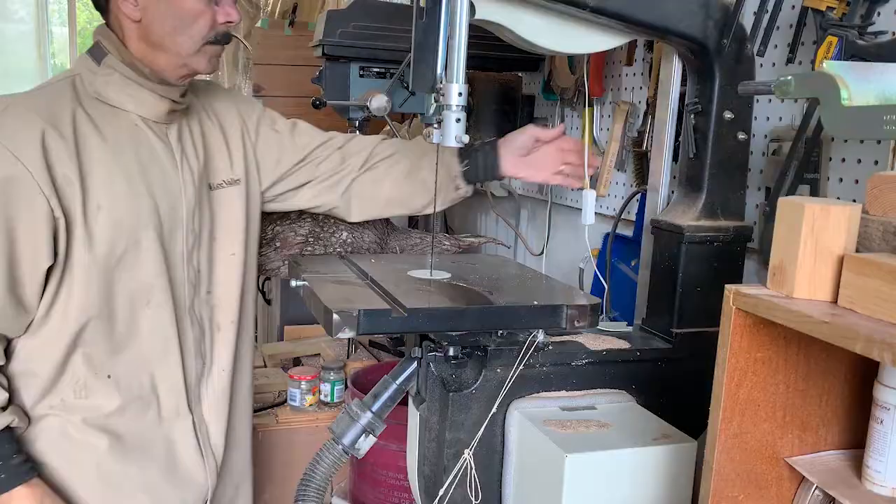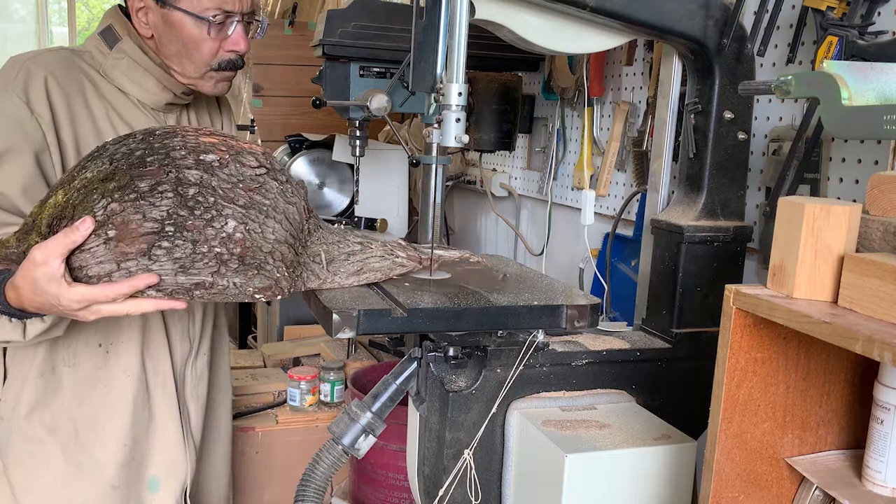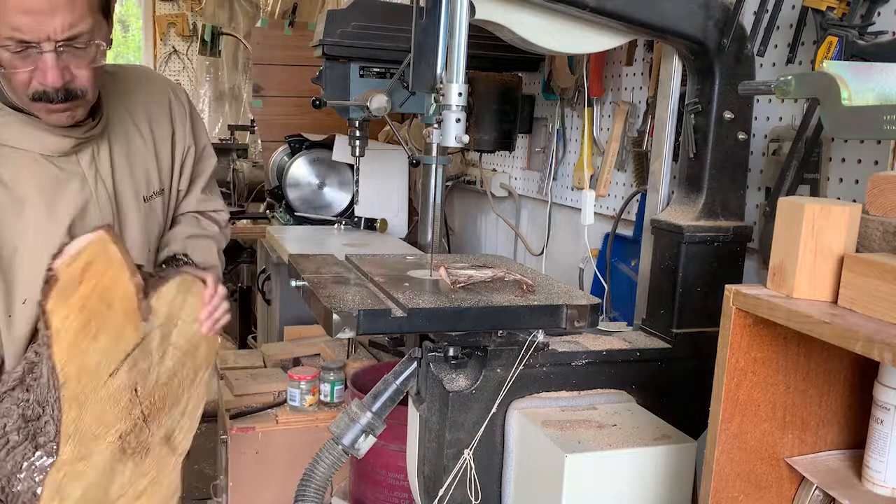Here I'm just marking the turn radius and how much of the wing I might be able to keep. My lathe can turn about 12 and a half inch radius or 25 inch diameter, so I do have to cut a little bit of this wing off in order for it to swing around. And the wing is sticking out a bit too far anyway — it just doesn't look proportional.